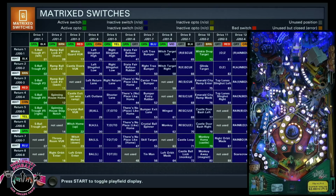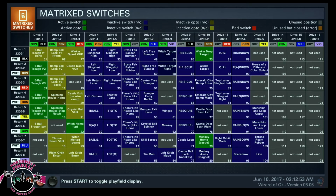And what that's saying is that switch, it's telling you that opto is working, but nothing's there. It's open. It's got an open pass through of the beam. The others are correct. Everything else that you're seeing up on the screen is the correct state of a good working WAS. And I have this picture in my phone because the manual doesn't have a picture of the correct state. It cuts it off about halfway over.